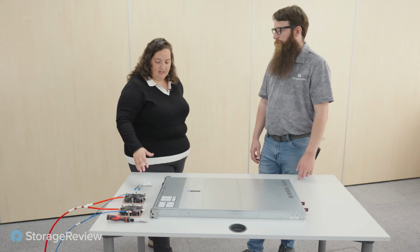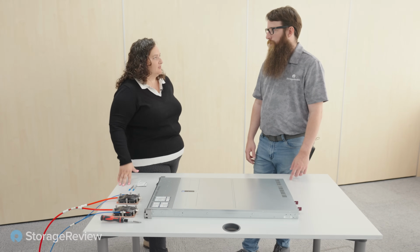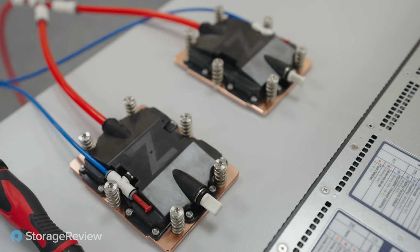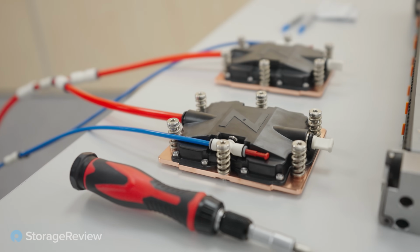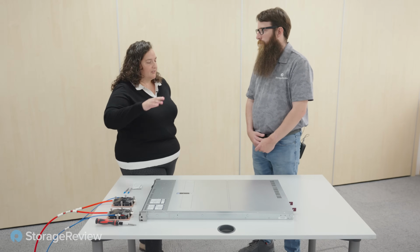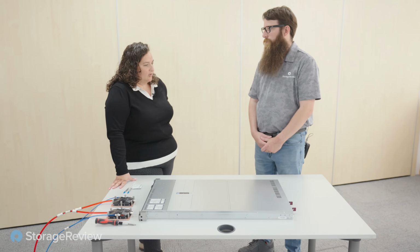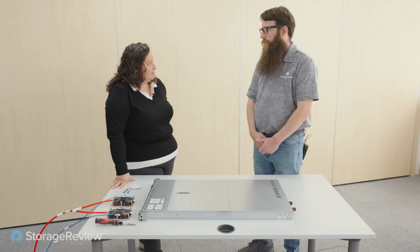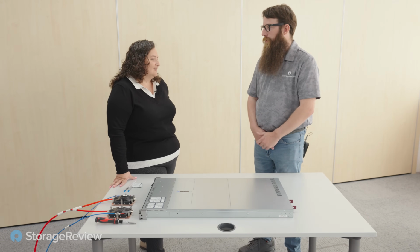So for example, Sapphire Rapids is about 23 watt per square centimeter. SP5, the Genoa ones, are, if I remember correctly, around 30 watt per square centimeter. H100 is 50, 70, depending how you look at it. We reached, about a month ago, over 450 watt per square centimeter. So that's significantly higher than where the tech's at right now.